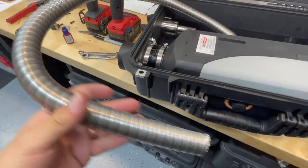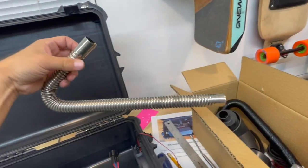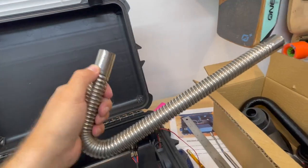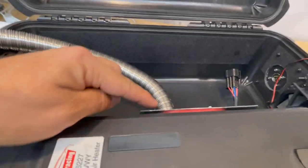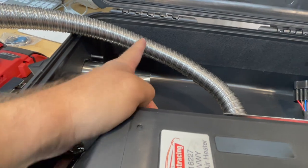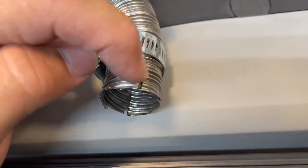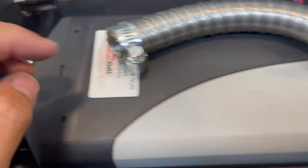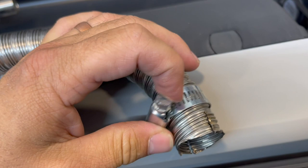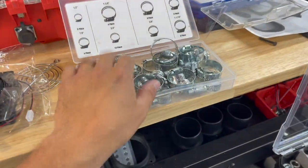You will have needed to purchase some name-brand exhaust piping. The heater kits come with this exhaust tube, but you cannot cut it to length - the inner diameter gets smaller at the ribs, so this will not work. You've got to buy the name-brand stuff for the exhaust. Go ahead and put it in here, give it a bend, find out roughly where you're going to need it to end, mark it, and cut it there. Once your exhaust is cut to length, put two notches in on both sides.